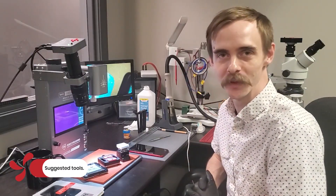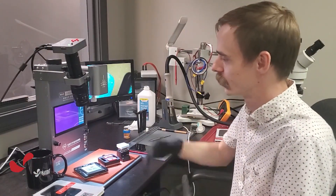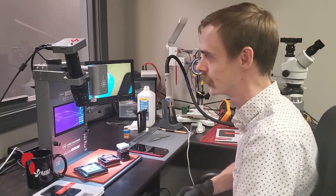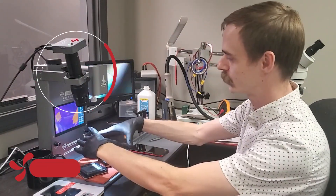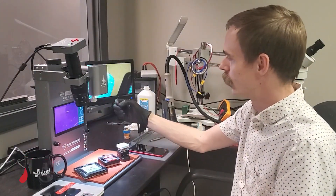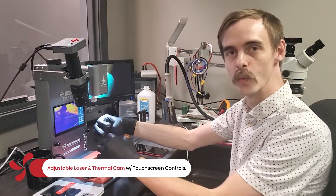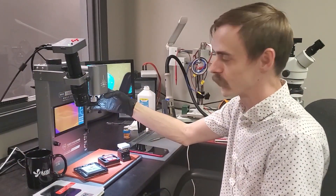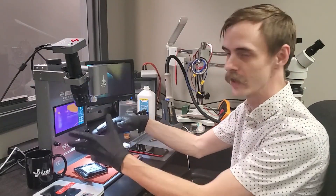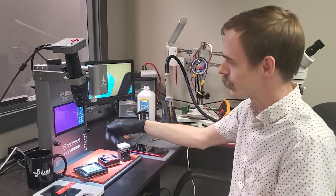So we want to get into the tooling. The first option we have is the TBK laser soldering machine. Going over the peripherals here — first we have our microscope camera which gives you a zoomed-in view on the display to show you exactly where you're working on the pad. You also have your laser with an adjustment so you can see exactly where you'll be hitting. There's a thermal camera displayed on the touchscreen giving you thermal readings of the temperatures in the area you're working on. It's also a touchscreen so you can engage the thermals and adjust the temperature and calibration options.